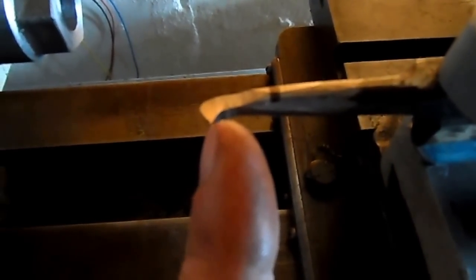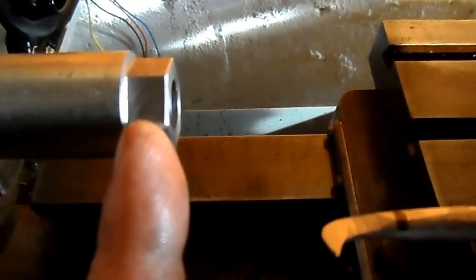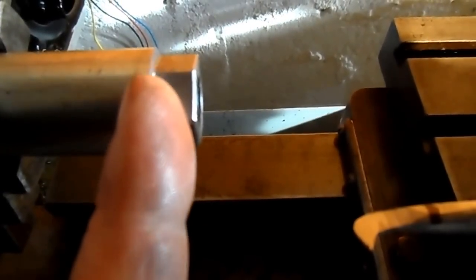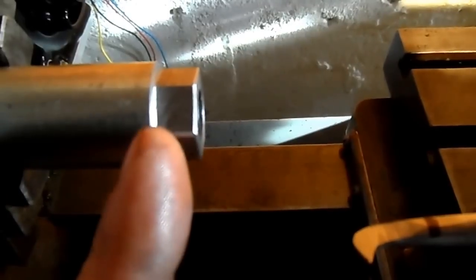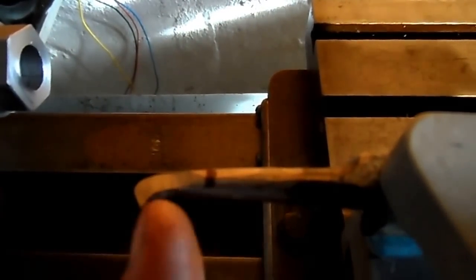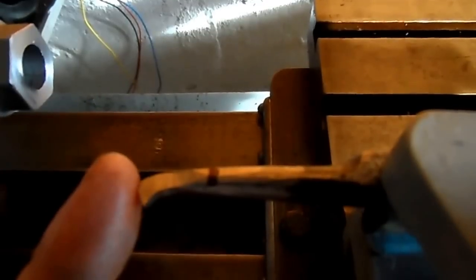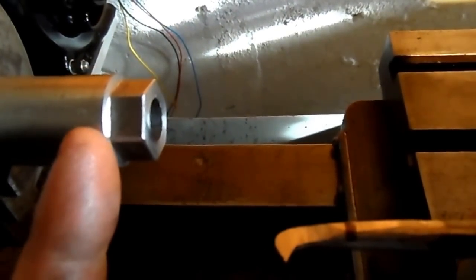I've measured the depth of the nut at 9mm. I'd like to give 1mm to 2mm as a face washer on this end before I part it off, so in total about 11.5mm to 12mm. I've measured from the point of the tool — that's my maximum depth at 12mm. With the front of the tool though, I'm basically nearer 15mm. The depth of the hole is currently 15mm, so it's a little bit close for my liking.